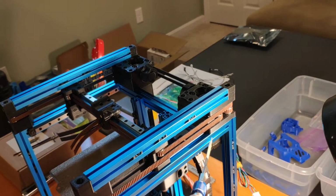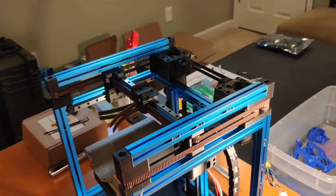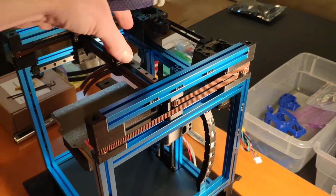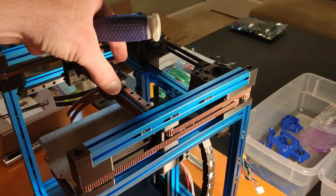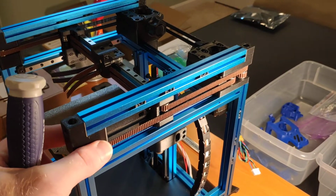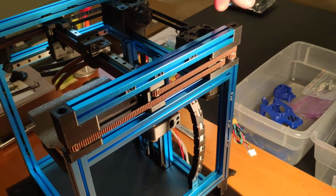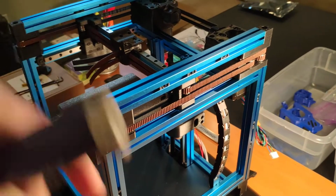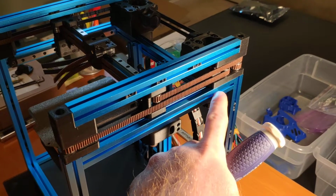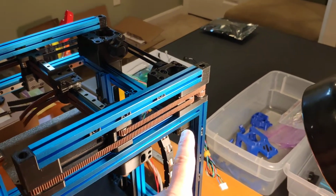I took out this blind joint, the screw in here, put some Loctite on it, put it back in, loosened up the other two connecting joints for that extrusion. Of course, as soon as I loosened things up, this racks no problem. And so I just was racking the gantry back and forth. I tightened up the front and then the back connection points first, got them good and snug. It would still rack. It was still good and smooth. Then I tightened up the blind joint just till it was snug, but not really what I would call tight. And then just left it that way.